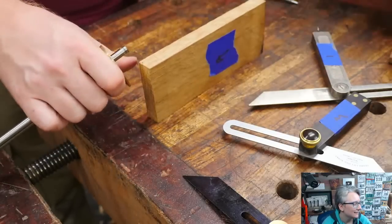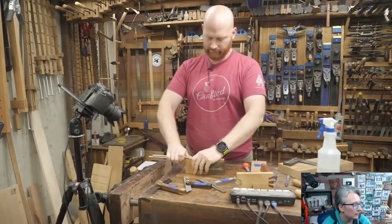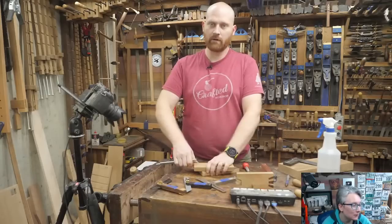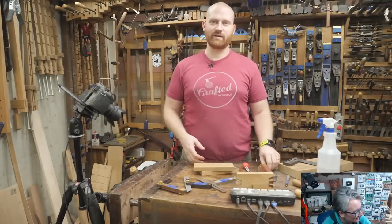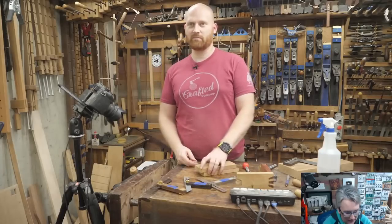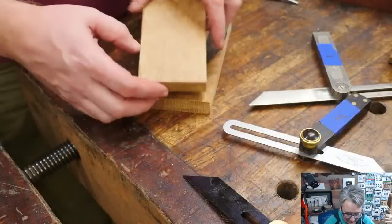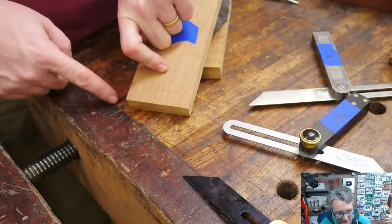That joke gave me a funny pop in my head — would this be the type of joinery that would be in DuckTales? They're DuckTales, like DuckTales! I was confusing it with TailSpin — that's the other spin-off with the bear pilot. Anyway, on the other board: one I mark all the way around and the other I'm just marking on the face on both sides, because we don't need to cut the shoulders so there's no reason for the mark to go all the way around. We're going to start with the tailboard, with the mark on the outside reference face towards me.